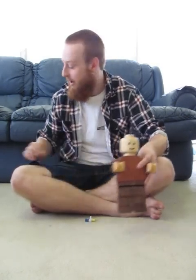So how I started. I got some designs of the Lego men off the internet, and I had to convert a whole lot of the measurements. So these are just 3 pictures that you get when you type in Google Images of Lego man designs, and they come up with some measurements. And then you need to work on your scaling. The reason why I chose the scale of 1 to 6.25, as odd of a scale as it is, is it's quite suited to timber. Across the middle section here, that becomes about 50, and with your 2-inch boards of timber, it's quite suitable. It also suited the larger bits of Huon Pine I had that were about 70 by 70, and then the other pieces I found around my shed.